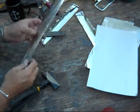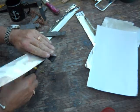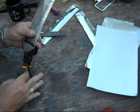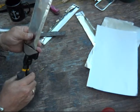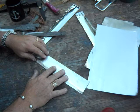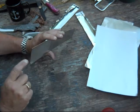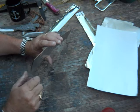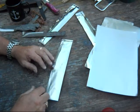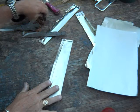Now I've got this edge fairly well sealed, and I want to do the same thing to the ends. I'm heating this to 1875 degrees — there's not going to be any oxygen inside this envelope. Some people like to put paper or something that will burn in there to ignite and remove the oxygen at around five or six hundred degrees. I kind of go with that school of thought.